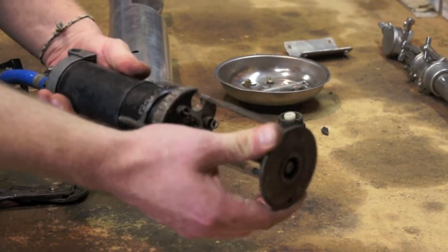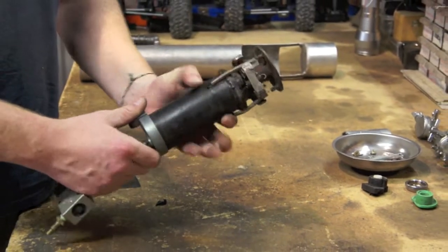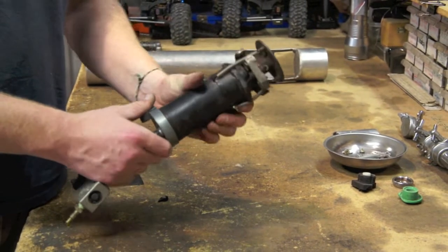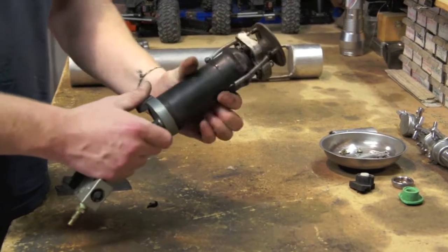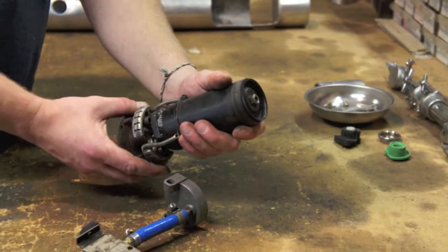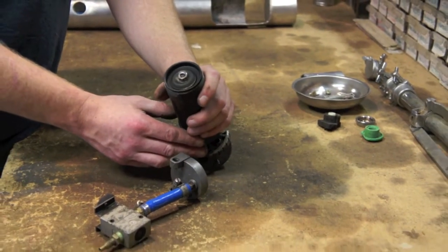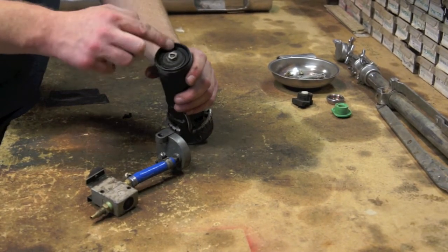It has three return springs set up on the cylinder to ensure it returns evenly, and a collar to ensure that it is always centrally located in the outer housing. We used the foot pump's original rubber piston seal with a custom rod.